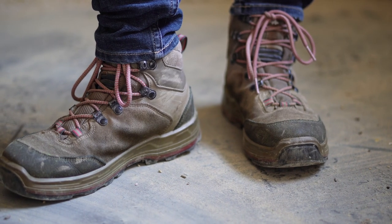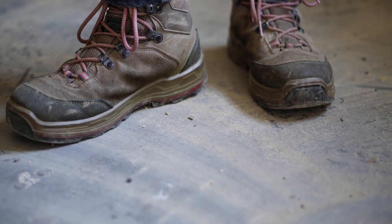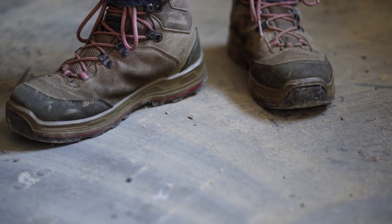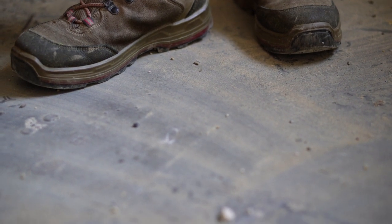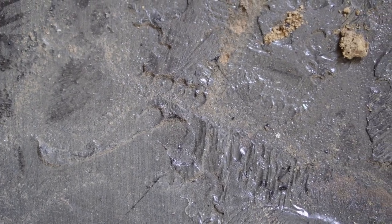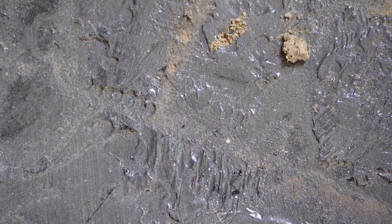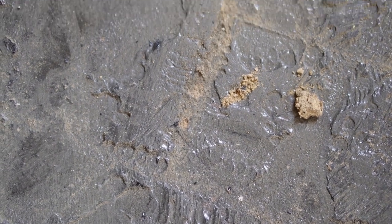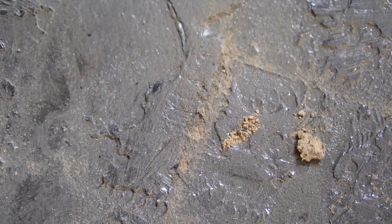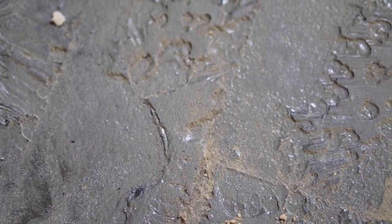We carefully removed the herringbone floor because that was really real solid wood, and we might be able to reuse that somewhere in the house later. And underneath we found a cement layer that seems to be tarred over with this black material that is probably there to prevent moisture from coming up. We'll have to take that out too.